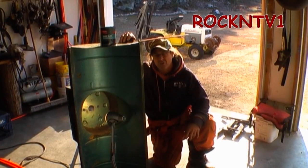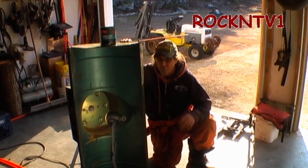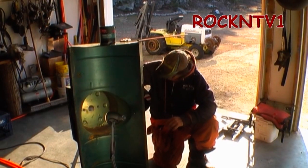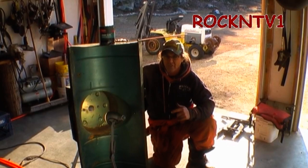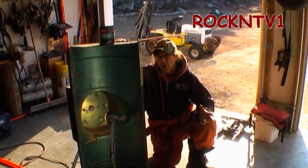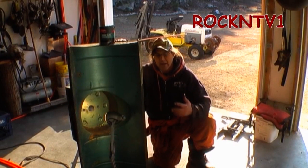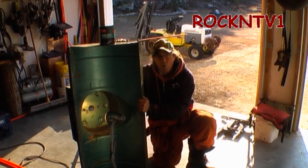You can see behind me — that's the tractor it's going on. It says Cub Cadet on it but it is actually a White GT 1855. I believe the old guy got the tractor and somebody had put this Cub Cadet snowblower on it. I found some Cub Cadet part numbers on the chute. None of the stickers were left on it, so there were no part numbers to go by. But after hunting snowblowers for this 1995 machine built by MTD in the mid-90s — they call it an MTD 990 or 998 depending on the transmission — and staring at those two microfiche breakdowns, the part lists cross over to some Cub Cadet part numbers, and after searching that up I decided this was a Cub Cadet 450 snowblower. That is different from the 451 snowblower, which is just the gearbox in the back.